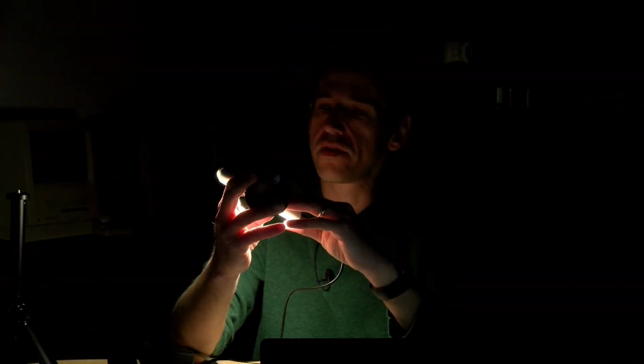All right, so how long has this been live for? Somewhere tells me how long I've been on. Okay, I've been on for 54 minutes right now. If I go to where the light first lit up, after we unboxed it, I think we've been using the light for about 48 minutes. So it's been going for a while. One guy in the Amazon reviews said it shut off after 45 minutes or an hour, but I don't feel it getting any warmer. I feel like it's gotten to its peak temperature. It's only consuming about 7 or 8 watts, so it's really not consuming a lot of power. It seems to be pretty efficient.